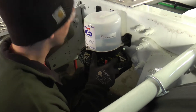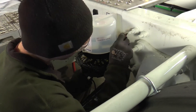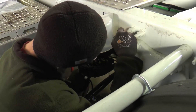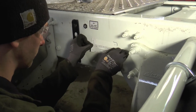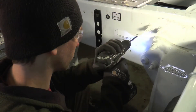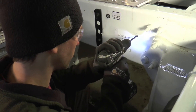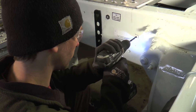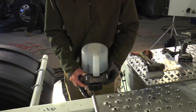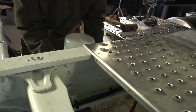The first step is to mount the pump to the location determined during the measurement of the truck. Identify the location, then apply the template decal which provides the mounting bolt pattern for the pump. Secure the pump using the nuts and bolts provided with the kit.